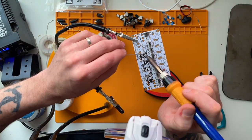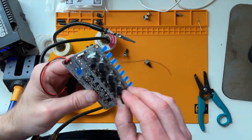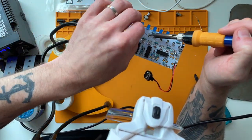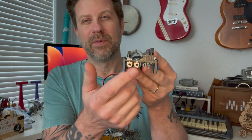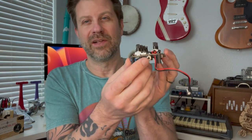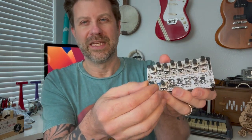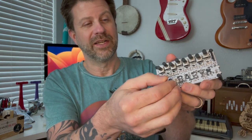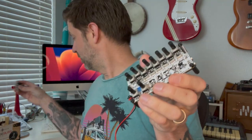Pay very close attention to the way the ICs are oriented. I do a technique where I solder a couple legs on the IC, then move to the next one, then go back, so they don't get too hot — ICs can sometimes be sensitive to heat. Still a very simple build. When it's all done you'll have two output jacks: one for the gate and one for the pitch. On this side you've got a clock input, a nine-volt battery, and all your pots — one for clock speed, one for duty cycle, and then eight for the pitches.